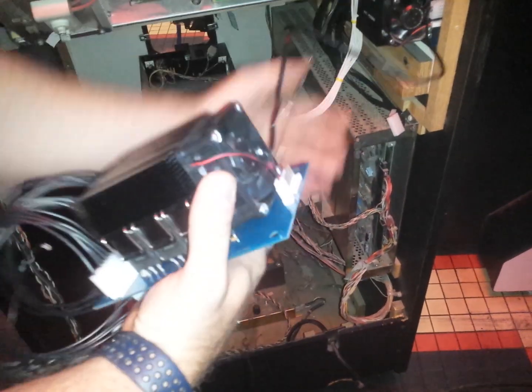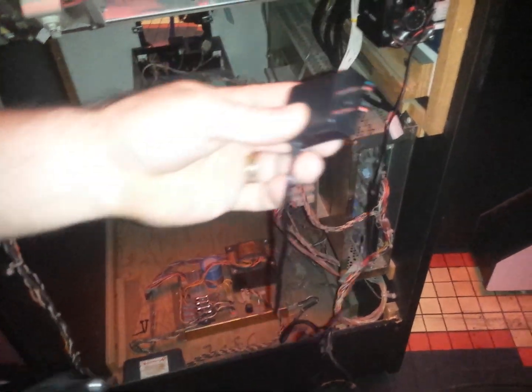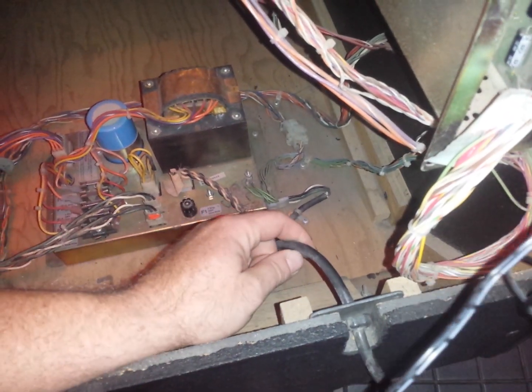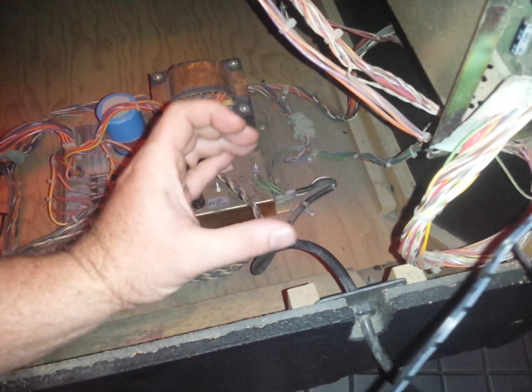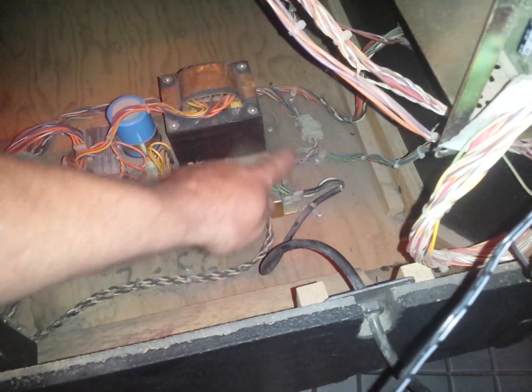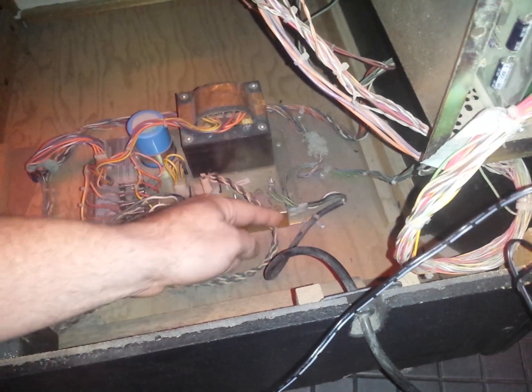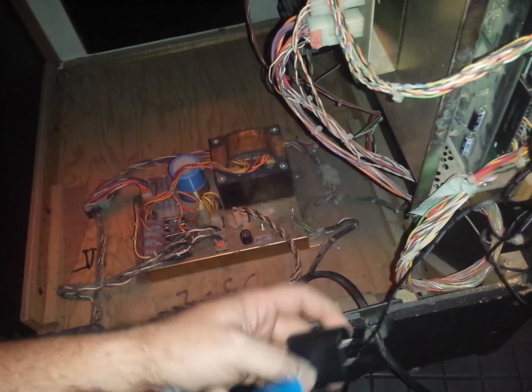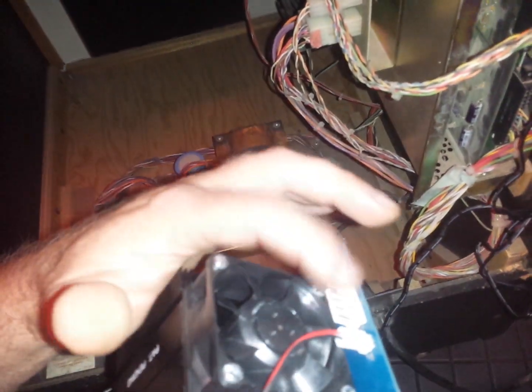In this example, we're going to demonstrate the other way, which is just with a little DC adapter. Our kit will have you just unplug where the 120 AC power is coming in, and we'll have a little kit with two plugs that you plug in and plug back into the power brick, then plug this into that. That way you don't have to hack any of the original harness. It'll give you an extra outlet, perhaps for a fan on the outside of your cabinet. That's option two — it's optional, additional to the transistor kit, and requires a little more expertise but is easy enough to do.